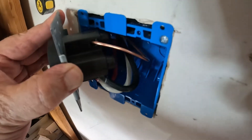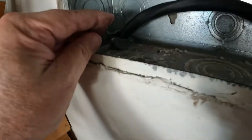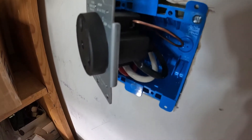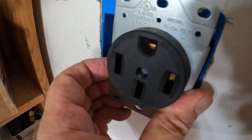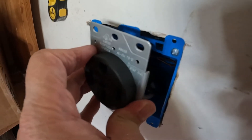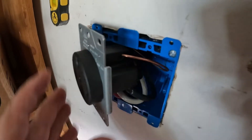What I had to do was fold those wires back some and tuck them — pull a little bit up out of this box and re-tighten that connector. You're never going to use a single box — this is a double box for the NEMA 14-50 outlet. It's really tough to get it in there, but you can. You just have to take your time, don't force it — just bend it and let it conform naturally.